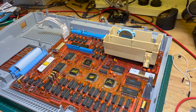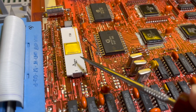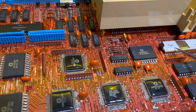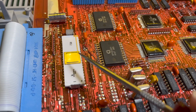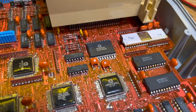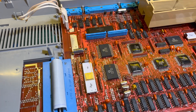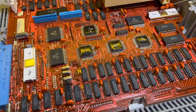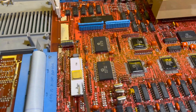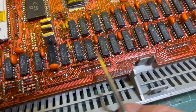On the main board, apart from having three crystals, the two main chips are these white ones — both the same: KM1801 VM2. So we've got a main CPU and a peripheral processor. When I say this is kind of a PDP-11 — well, it's not really a PDP-11 clone, but these chips are based on the PDP-11 instruction set. PDP-11 is before my time so I might be throwing around the terminology loosely. They're not 8080s, not 8086s, not Z80s, not 6502s — they're based on the PDP instruction set, not directly compatible because they have additional commands.